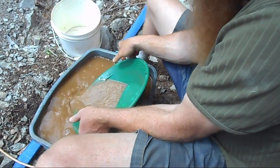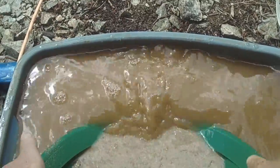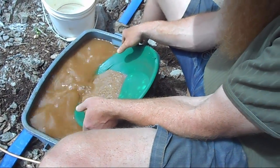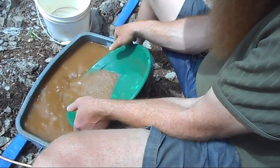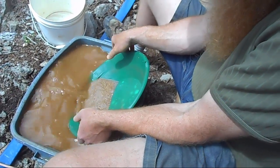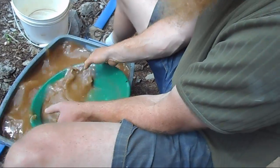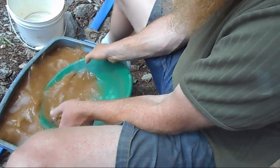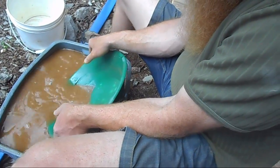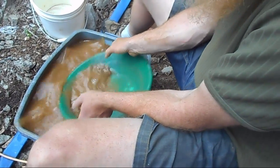The heavies are coming out the back there. We could have a lot in here — lots of pyrites, arsenopyrite, and pyrrhotite, and all those heavy things. Tellurides. Gold, of course. When you went down and checked on the tailings bin, was it full? The one I switched out was only half full. It didn't look like we lost much, but your sluice is too flat — it was filling up. I didn't worry about it because I knew we were going to redo all the tailings buckets. We can modify that very easily — two screws and drop it. Four screws and drop it.